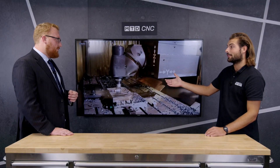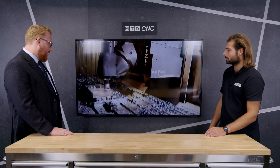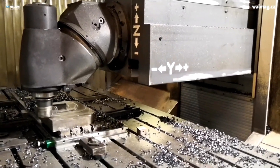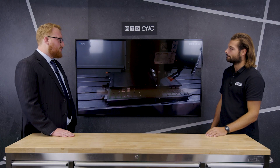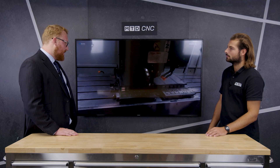For a hefty U-drill right there — exactly. But for most applications, like you can see there, you can get away without any stops visible at all — that's some pretty hefty face milling, which is pretty cool. You get access to all sides of the component. So you use the stops to stop the part from slipping if you have a high force operation. How repeatable are those stops for repeat work? If you're putting the same job in, can you leave the job and not probe it up before the next operation? Yeah, exactly. If you're using stops, it's exactly the same as you'd see in fixturing or with a vise — as long as you're putting the component up against the stops, you know it's going to be in the same place every time.